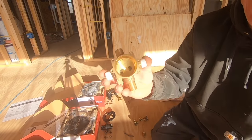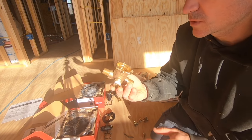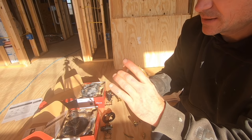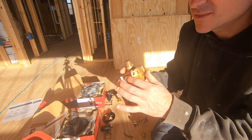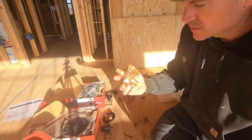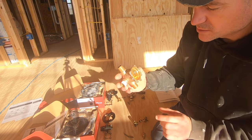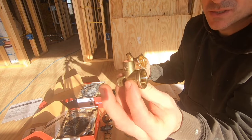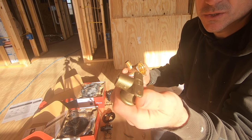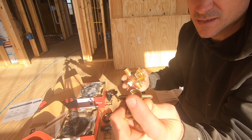Now that we've got that all out, there's nothing in there that can get damaged when we're soldering this copper in. What I'm going to do now is go over and dry fit these on each of the showers, get my side fittings put on, measure for my pieces of copper to go down to my tub's drop ear. I just use these drop ears that I can screw into a 2x4, and these are set up for soldering copper into.